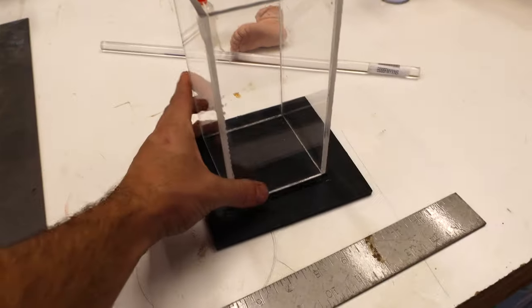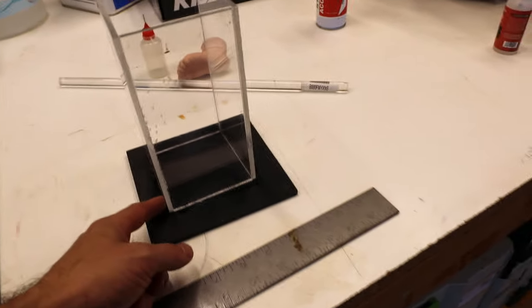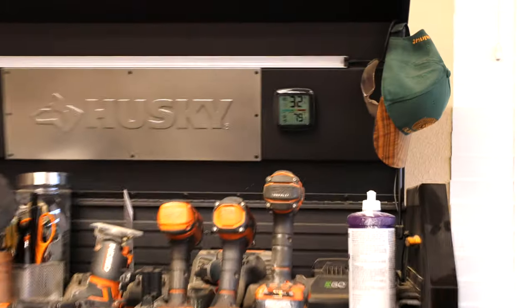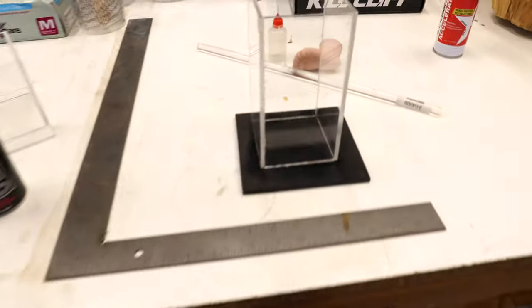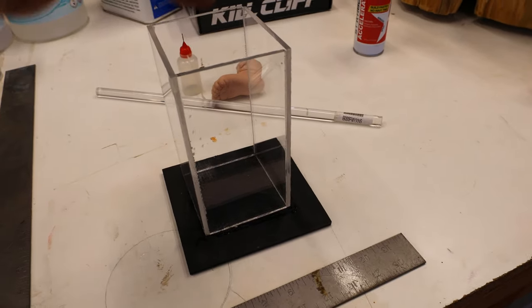But if you were doing a colored pour like I am with the other one over here, definitely do this down, do your base pour, let it almost cure. I use the deep pour stuff for the like 3/4 inch or 1 inch. It'll take a little bit longer, but it's gonna be 90, I think, today. 79 right now, so it'll cure pretty quick, or at least halfway cure, and then you could do the can glue down, and then the big pour.